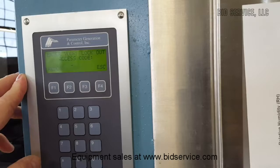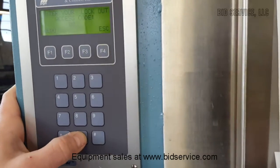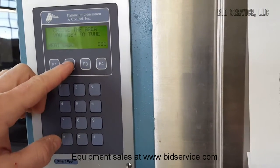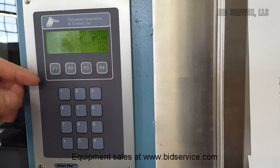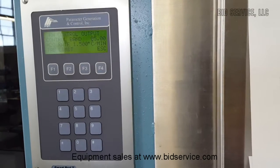In configuration, you'll come up with this screen and it will ask for an access code. The code is 0000, and it gets you into the tune mode. You're going to be operating under a cascade, and you can go through and change the parameters for PID values and how the unit controls.